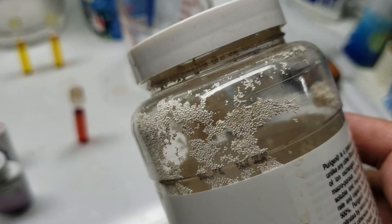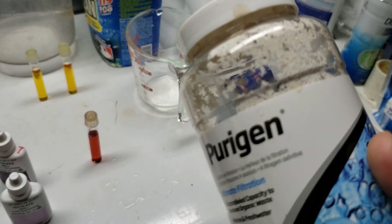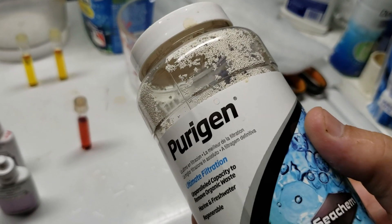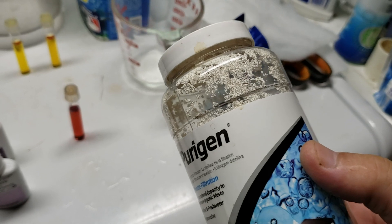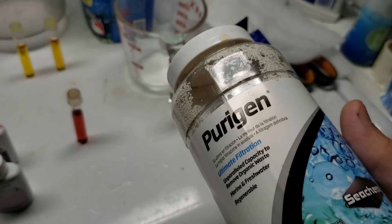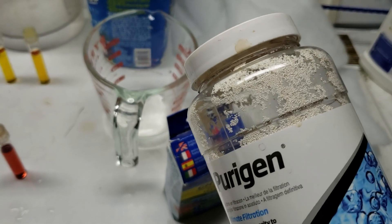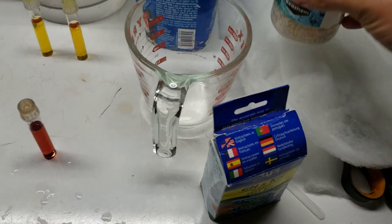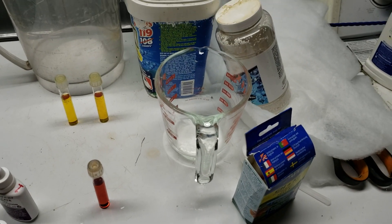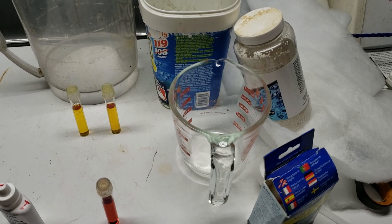It is specific for nitrates. There are two different types of ion exchange resin: there's the kind that will get full and then when it's completely loaded up it dumps all of its junk right back into the water — so if you don't catch it before it's full you'll basically flood your system with whatever you've been trying to take out. And then there's the kind that needs to be stripped clean using sodium ions, which is why I put salt in my water softening system. It backwashes and restores the ion exchange medium so that it never gets full of nitrate.